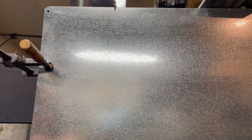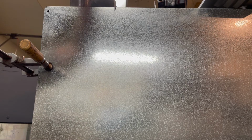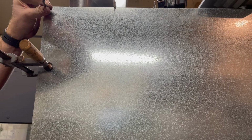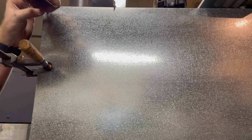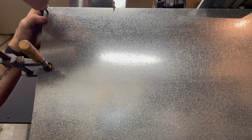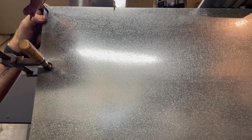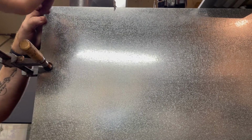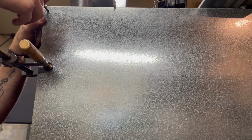The reason why I like to tap things, that's what she said, is because I don't like sheet metal screws. They're a pain in the butt to put in, for starters. Usually you have to drill a hole anyway, especially through this eighth inch. And then, if you strip them, nothing holds. Then you can't get them out either. They're just really awful in a lot of ways.